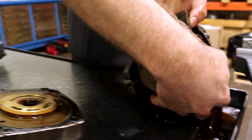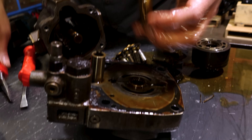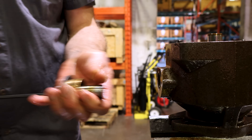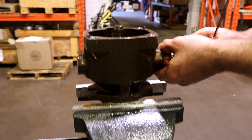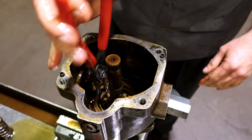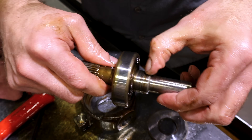PVP 16. This is going to pop. This also has something called a creep plate in it. It's got two grooves from the shaft seal, so that shaft is no good — it's cheaper to replace it than repair.